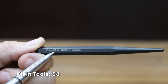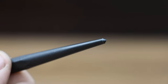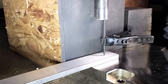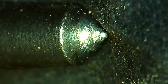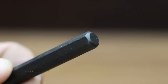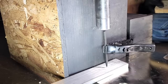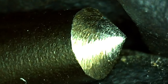At a price of $8 is the Klein Tools brand. Klein Tools claims their ground points are heat-treated to stay sharp and true longer, with high carbon steel for durability and a corrosion-resistant black finish. Made in USA. There was a small bounce but very good impact, and the Klein Tool punch performed the same as the Wild Tool at 0.0385 inches — still looking as good as new. Also at $8, the Williams brand is made of heavy-duty, industrial-grade steel and is made in USA. The Williams made a solid blow with a reading of 0.0335 inches — not quite as deep — with no damage to the punch.